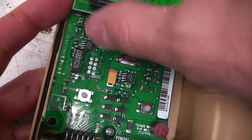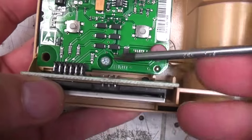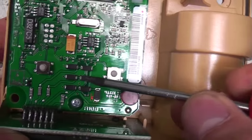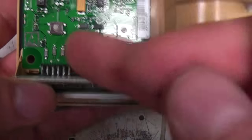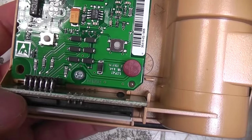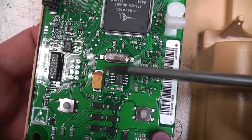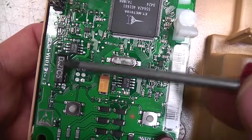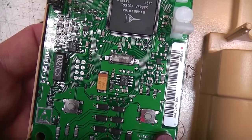There's nothing particularly exciting in here if we pull this display off. We've got a smart card slot down here. There are some protection components and a fairly big chunky transorb or something similar - part of that's for static protection but some of it may also be to prevent someone inserting something here and spiking voltages to make it do things it shouldn't. There's a micropower voltage regulator and a comparator. Next to some 32kHz crystals that might be used as an oscillator for the real-time clock.